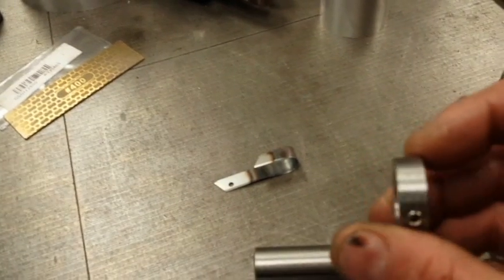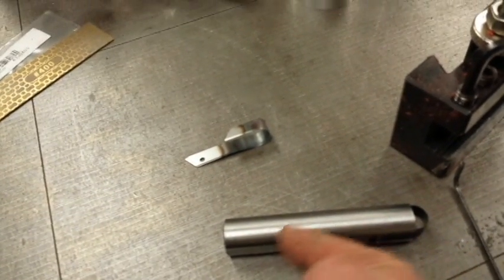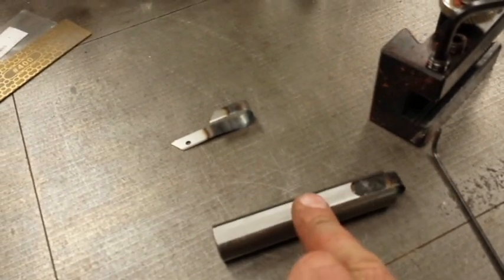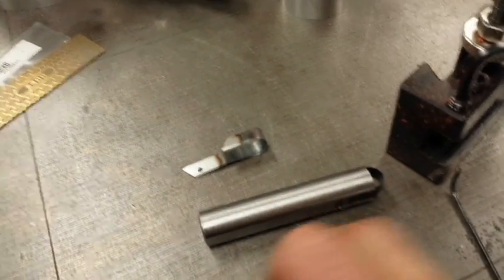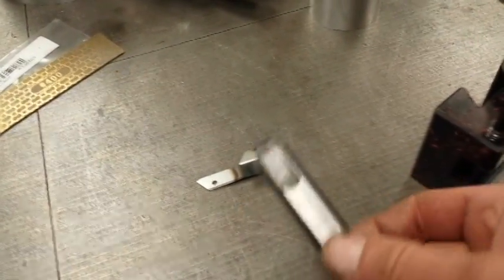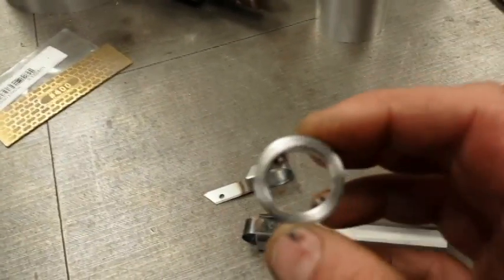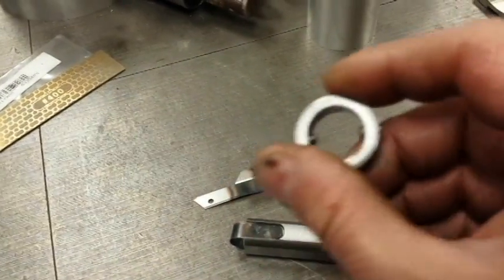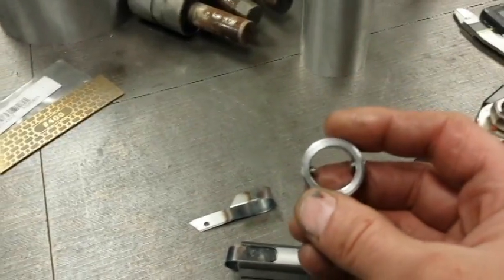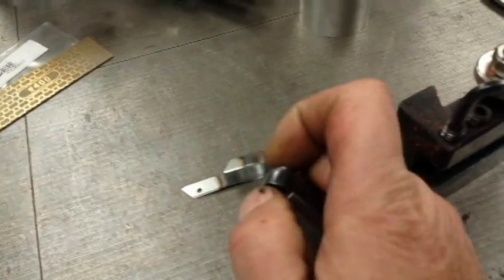Here you go. I machined one of these little collars, which has a three-quarter inch bore — around 0.720 ID, quarter inch wall, with 10-32 set screws on each side. The shaft is 4140 HT, which was probably heat treated in advance — it was pretty hard. You don't have to use that; it's so little stress to actually machine rubber, I went overkill on the material. And that is the whole of the blade.